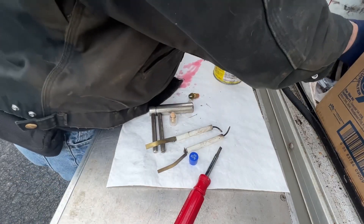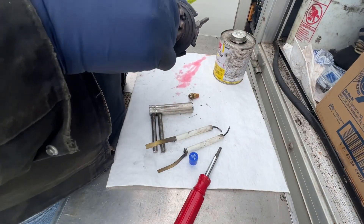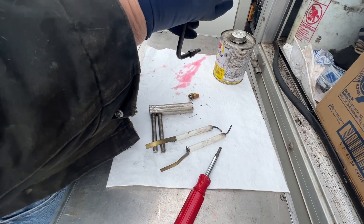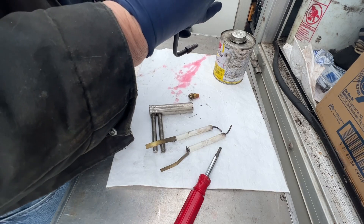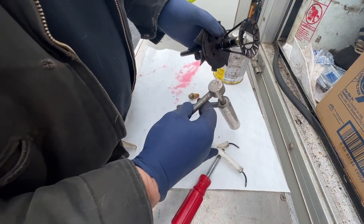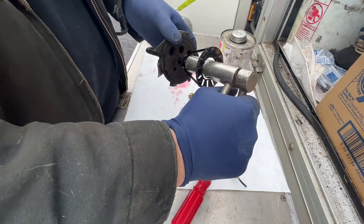I'm just doing this as a prophylactic measure on the burner. I'll be servicing this in the summer, so I won't change the nozzle again. This nozzle will carry them through until next year. But we're going to check that transformer — I kind of suspect that maybe the transformer is the problem. We'll know shortly.